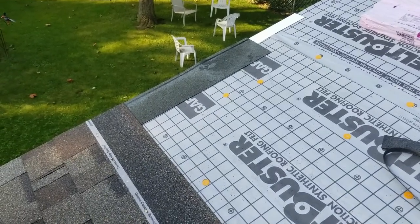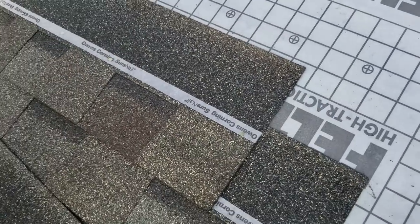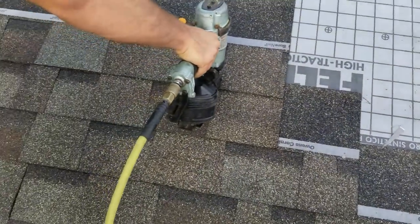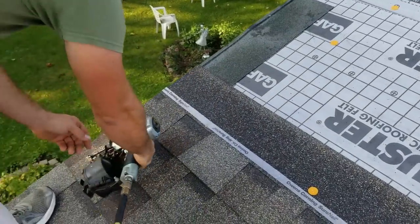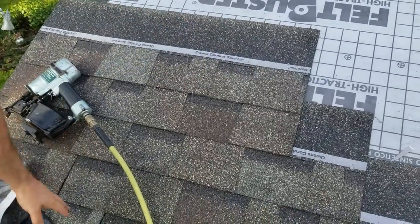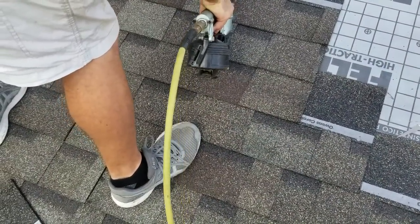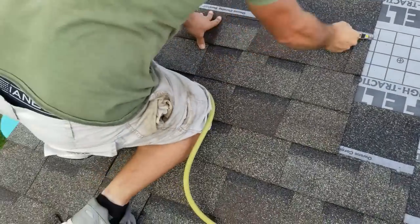All right, so this is a nice full shingle — this is your first shingle of three to make your stair steps. Make sure you're watching good. You push to the edge so you never have to cut off that side — give yourself about a knife-width plus the plate. Now this one — we're going off a nice straight side. You want to leave a stair step so you don't want to go in the center, you want to go a little to the side — skip over and add your three nails. This will be a knife plus an inch, twice.